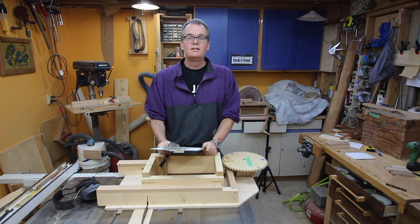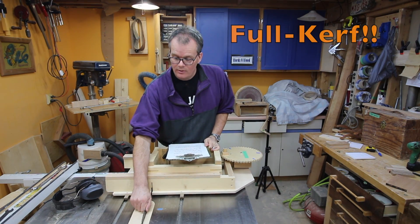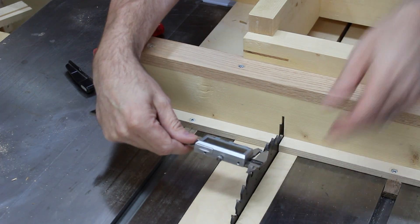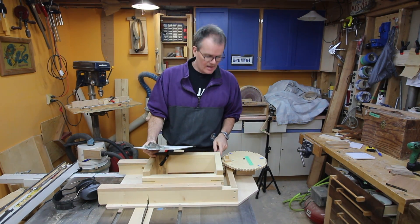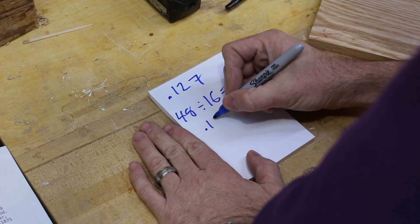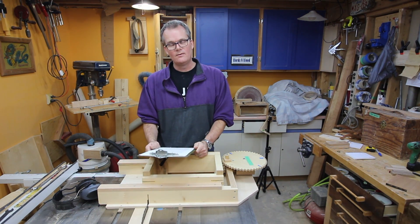Let's take the math we just figured out and apply it to the project from the last video. In that project I wanted thinner finger joints, so I just had a regular full-tooth saw blade in my table saw, and I measured with my caliper that it was 0.127 inches — that's close to an eighth of an inch, not quite exactly. For that project I used the same 48 tooth gear but this time meshing with the 16 tooth gear on the rod. 48 divided by 16 is 3, so for every turn of the big gear the rod turns three times, which works out to 0.1875 inches of travel.